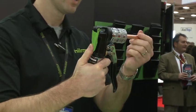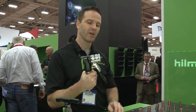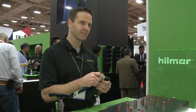It's got a quick button release right there. Press that button, pop it off, and you have your perfect swage right there to join any piece of copper. It's a very versatile piece as well because you can change out your head and go all the way up to an inch and five-eighths swage.